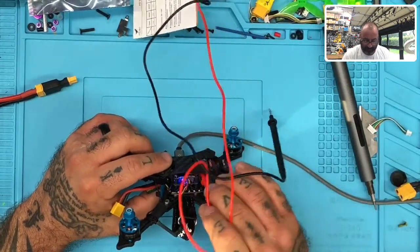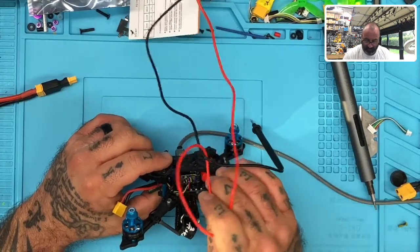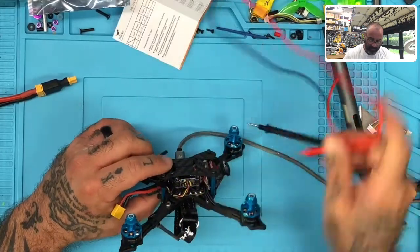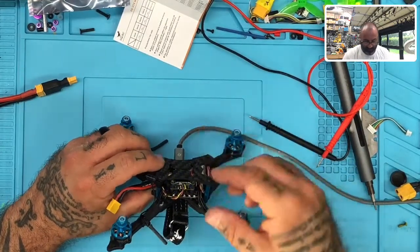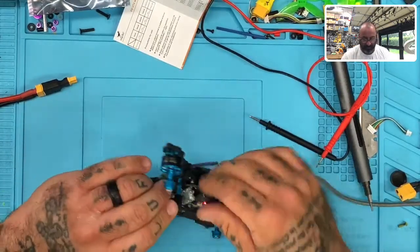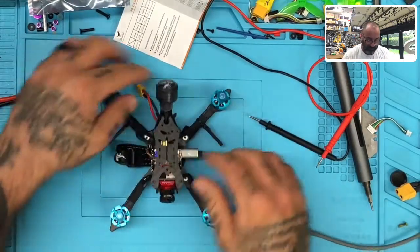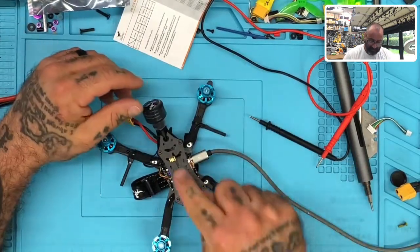You don't wanna take this gap up with your receiver, all right? I wouldn't do it. Let me go ahead and get this out of here so we can get these wires clear so it can at least breathe there too, all right? And so he's gonna end up opening this up anyway, so I'm leaving it like that so he can just fold it over. Now, normally we would take it and fold it the other way, but his receiver's on this side. So in the notes that I send him, I'll tell him he needs to rearrange his receiver, put it how he would like it to be, but it needs to not sit on top.